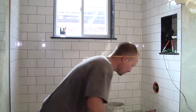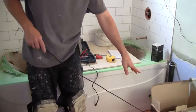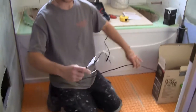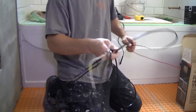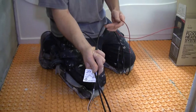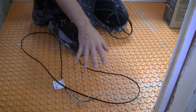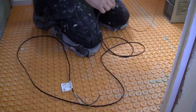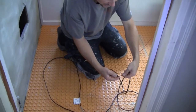Once you've got that, you're ready to install the cable. I put a bar through the box — they have it set up so you just punch out the holes and bring the cable through. The black part, all of this black section, is not live wire. It is not heated wire, so you don't need to put that on the ground. It will go up the wall where the electrical box will go.